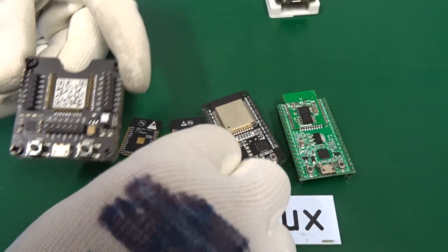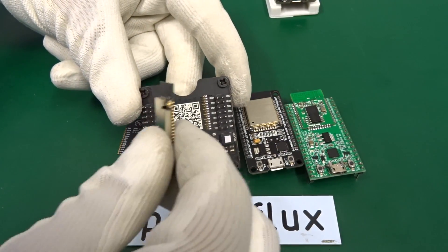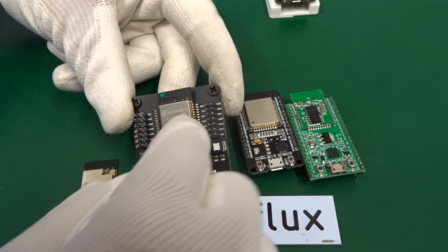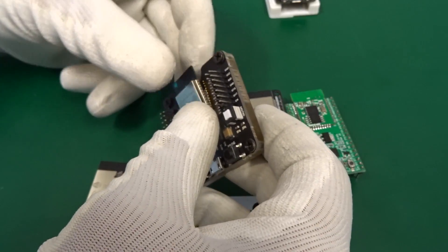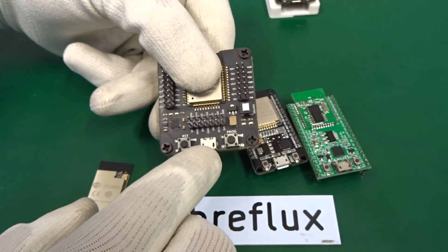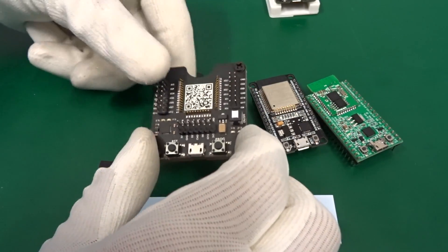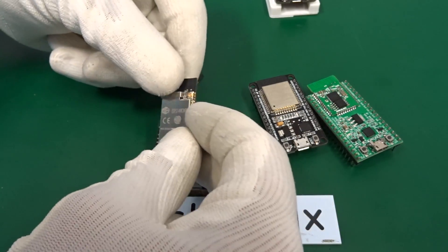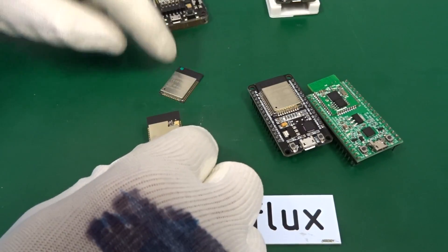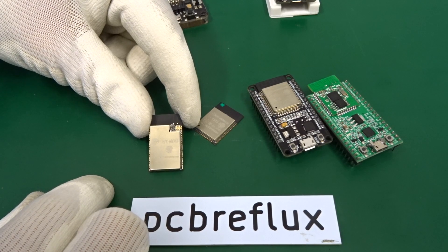There's a little bit of a disadvantage. This is the flash adapter for modules — if you solder them to your own boards, you can pre-flash them by putting your module into the small pogo pins and then flash it via USB connection. After flashing, you just remove the module and you're done. But certainly this doesn't fit the WROVER module, so today I'll prepare my own adapter for this small WROVER module.